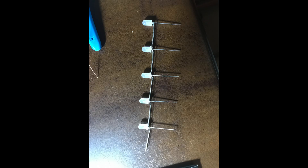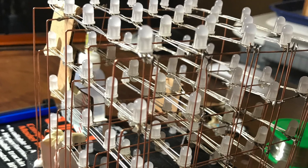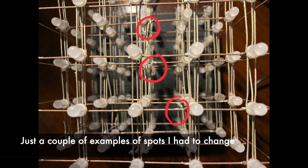I began construction, which meant soldering 125 LEDs together, each with four connections — that's 500 connections. I had to solder a strip of five LEDs 20 times, then solder those into four planes, then do the LEDs in the base, and then the resistors for the port pin connector. In all of this assembly I made a big mistake: I hadn't looked at the charlieplex diagram closely enough, and assumed I could assemble the cube first and make modifications afterwards. I got to the point where the cube was fully assembled and glued together and couldn't be taken apart, and realized I needed to make changes to connections in the middle of the cube. I had to gingerly stick my soldering iron in to make those changes — miraculously without melting an LED.